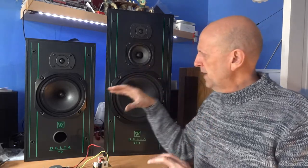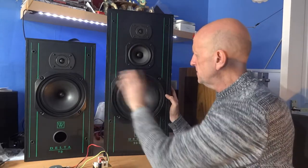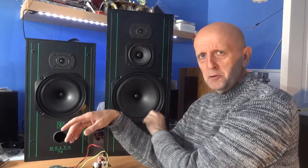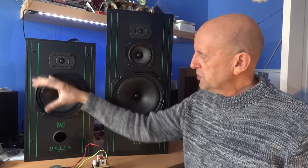Just bear that in mind. I've done a fair bit of experimenting and it was quite apparent on one speaker rather than the other, but it's covered in other videos too: make sure these screws are kept tight, because the speakers are vibrating and the screws will come loose over time. Some fixings go into metal so they stay fairly tight, but others go into wood, and the vibration loosens them. I haven't bought a pair of speakers yet where I haven't had to tighten them — maybe just a quarter or half a turn. They've got their own gasket inside and keeping them tight makes a massive difference.